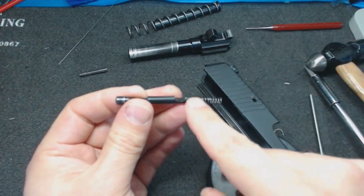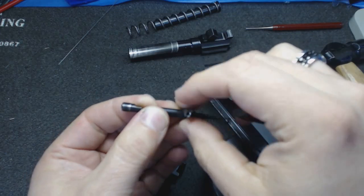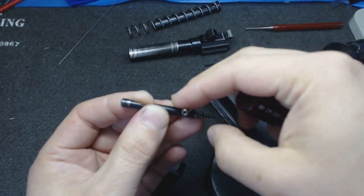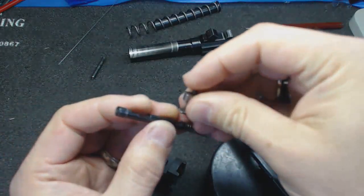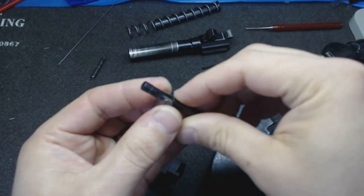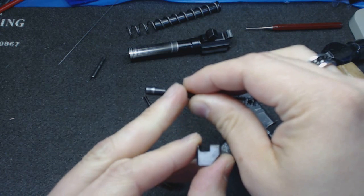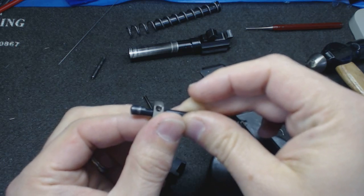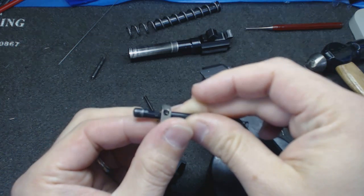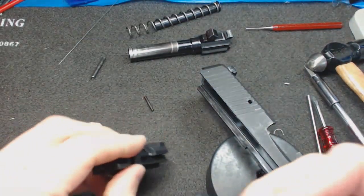You'll see several different grooves in the firing pin. This one is just where the roll pin goes through, and so the roll pin is also capturing the firing pin. And then this ledge is the safety. So if I dump out the spring, essentially what's happening here is that the safety, when nothing is pushing it into the up position, is here, which means it's going to bounce into the safety right at that ledge, and that's not far enough forward for the firing pin to actually clear the breech face. If something lifts the safety up, though, now it can come all the way to the back. So normally it can only go so far, but with the safety disengaged, it can go back further, which is just enough room for it to pop out the front.